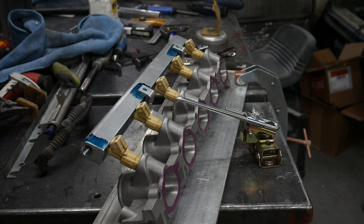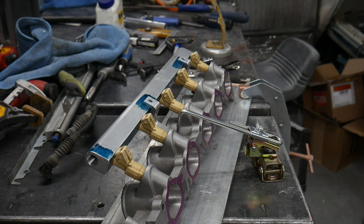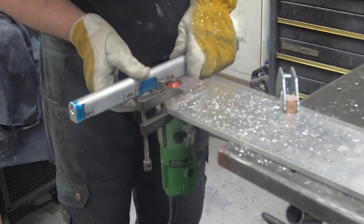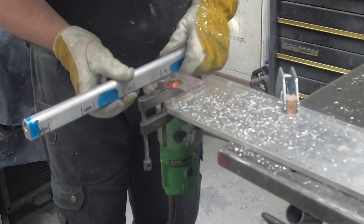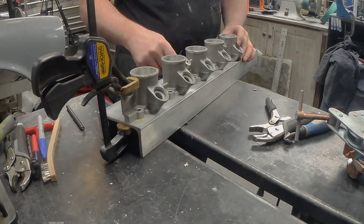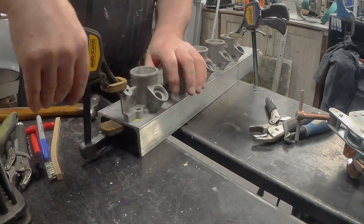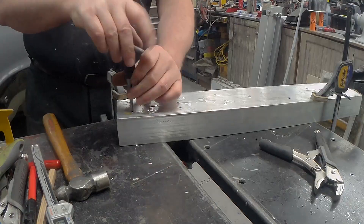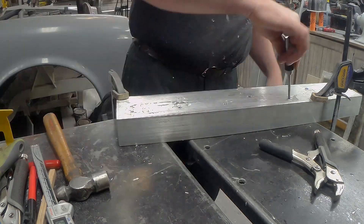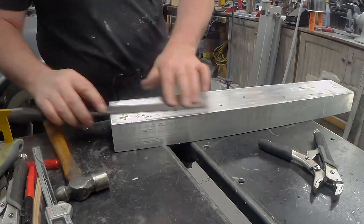With that figured out, we're going to get the runners welded on and then get all the plenum parts done. Again with the woodworking tools — I've marked off the area where I need to trim and I've got a little trim router. I think it was a $30 thing with a plastic base, and it'll probably kill me one day, but I've been using that little tool to trim aluminum for maybe a decade. Now I need a big piece of C-channel here — I'm just going to be bolting the entire plenum down to try to keep everything flat when I go ahead and weld all this stuff together.